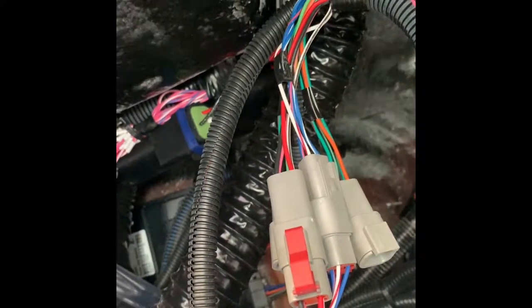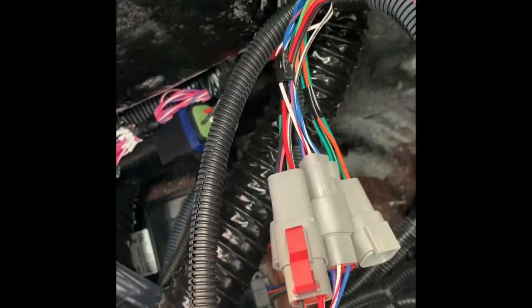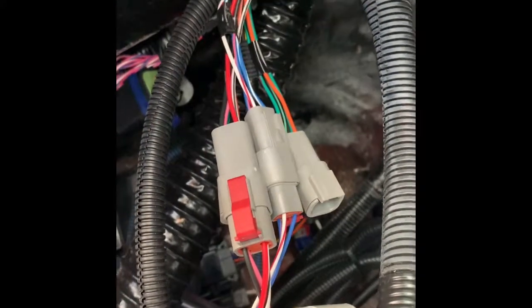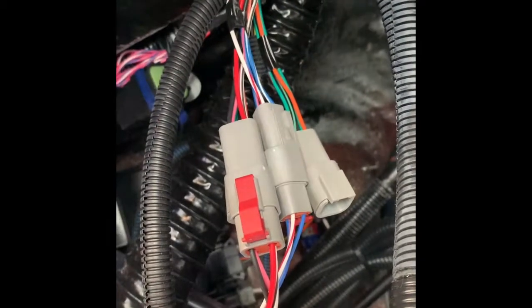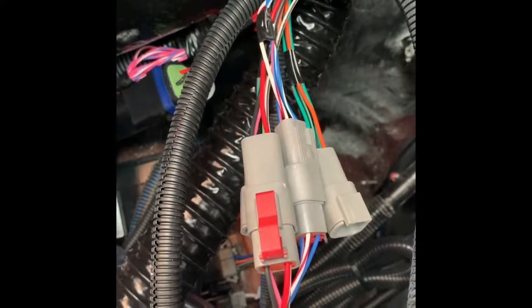We still need to do the software update for the head unit. If you're going from a Garmin system to an ECI system, the head unit requires different software, and I have a video for that as mentioned earlier. But the ECI puck itself is installed and ready to go — nice and easy. I'll put my contact information below this video if you have any questions. Should be nice and simple and clean. Hope it works well for you — have fun on the water!